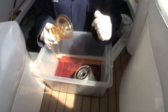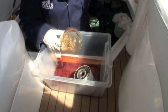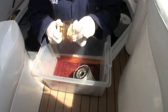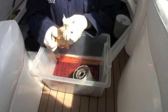There's also another o-ring on the pump body that we'll need to change before we put a new filter on. What I like to do now is just give the filter bowl a really good clean-out to get rid of all the crud in there, so that you're starting afresh with the new filter.